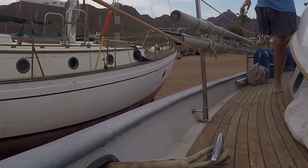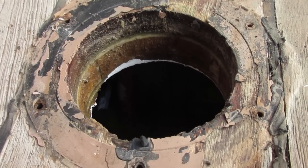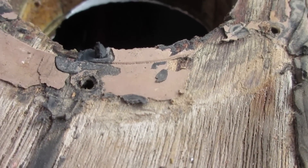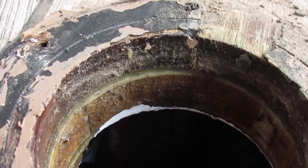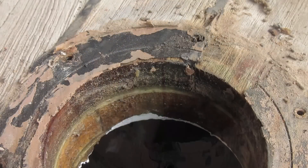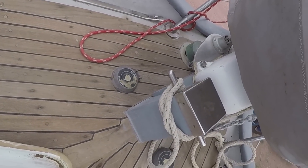One of the projects I wanted to accomplish was to pull the teak decks. I began by removing some hardware on the foredeck. After removing the hose pipe, I was amazed at the thickness of the teak — it wasn't at all like the thin stuff I have seen in some YouTube videos, and it gave me pause. This was major teak. Bob Perry advised against removing the teak and noted it was thick and traditionally laid with a lap at each edge. We've had no leaks with the teak, other than at the chain plates, but it does need to be re-caulked and a few plugs put in over screws left exposed by the previous owner. A change in plans, and an order for a case of teak caulking was placed with Jamestown Distributors.